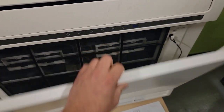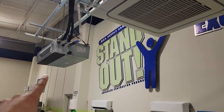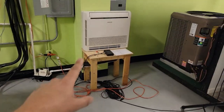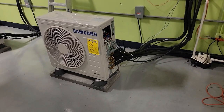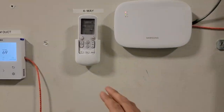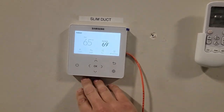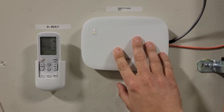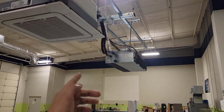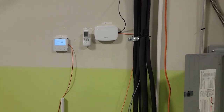Consoles come in 9,000 BTU all the way up to 18,000. We've covered the four-way ceiling cassette, which blows around all four sides and sucks in the middle, the ducted unit, and the console. All three indoor air handlers connect to that Samsung outdoor unit — this is a VRF heat pump. For the four-way cassette, we have a wireless remote controller. For the slim duct, we have an advanced wired controller made by Samsung. We can also use a Wi-Fi adapter for the SmartThings app, which lets you operate the air handlers from your smartphone, tablet, or computer.